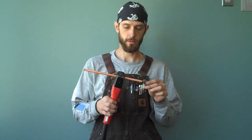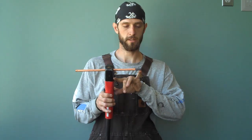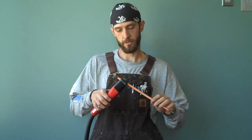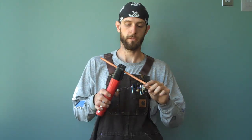The electrode goes in its holder, and you want it anywhere from 4 to 6 inches away. You want to hold your electrode holder at about 45 degrees and travel in the direction of your cutting. This swivels all around so you can do overhead, vertical, flat — whatever you want to do with it.